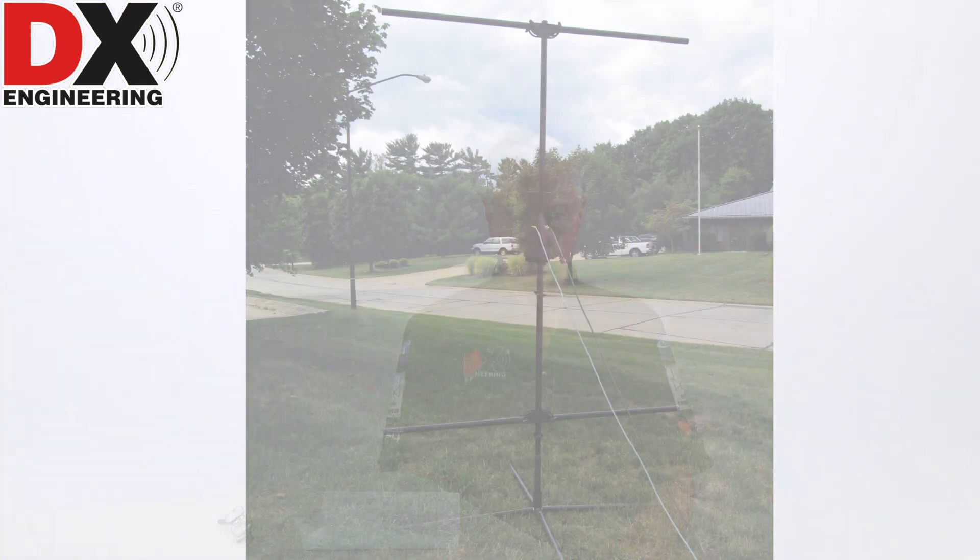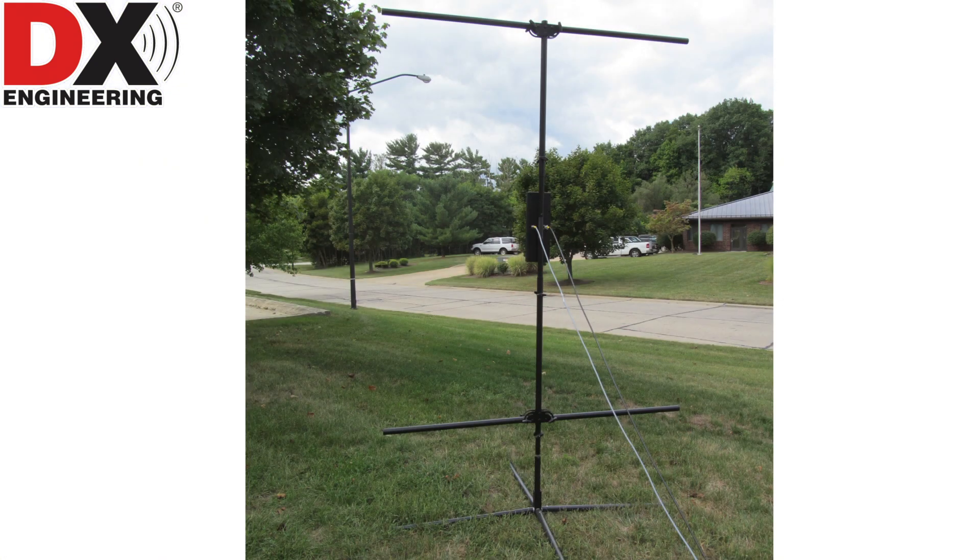I had a customer with a TW antenna and our 40 meter box who couldn't get his SWR under 3 to 1. I first checked his setup — did he have all the connections right, was it assembled properly, everything screwed tight on the antenna, and did he have the right length of coax. We recommend 75 feet of coax strung out, and he was alright there. The next question was what was it next to — a metal building would detune the antenna — but it was in the open and he had everything right.